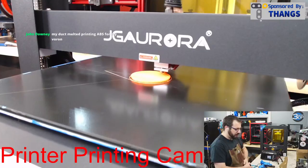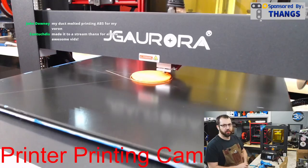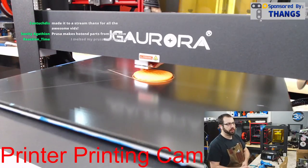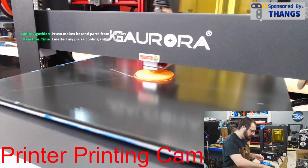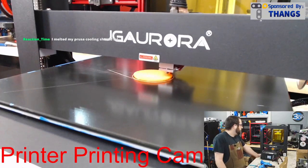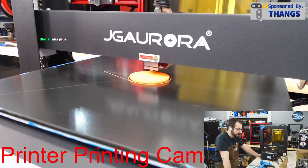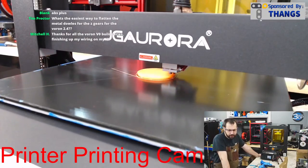Basically, think of it this way. Build your printer out of one step up for what you plan on printing. So in an enclosed printer, if you only ever plan on printing PLA, PETG is probably fine. If you plan on printing PETG, print it out of ABS. It's like when you're cutting metal, you need to use something at least similar or harder, right? You're not cutting steel with brass. You're cutting brass with steel. Even my Monoprice Select Mini, I printed an extruder mount for it in PLA, and that melted eventually.